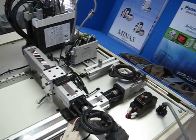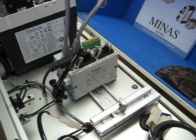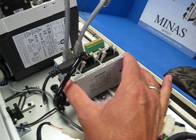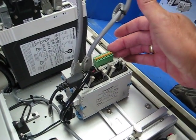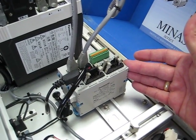At the heart of our system is the Panasonic FP Sigma PLC. Probably the first thing you notice is how small these are — they're about the size of a pack of cigarettes. We actually have two modules here: there's a motion module on the left we're going to talk about in just a moment, and the PLC CPU here on the right.